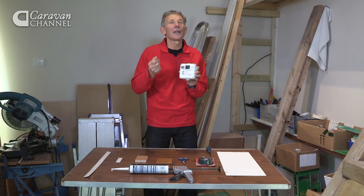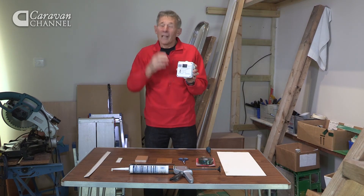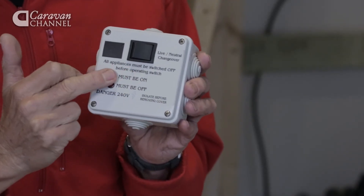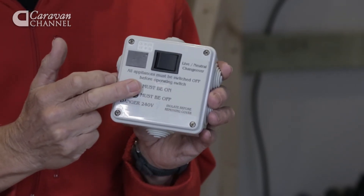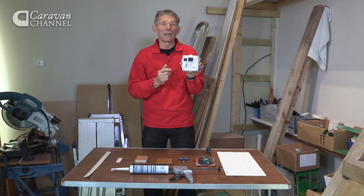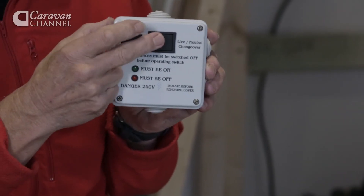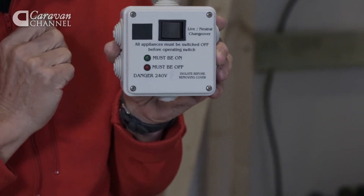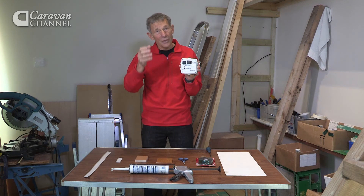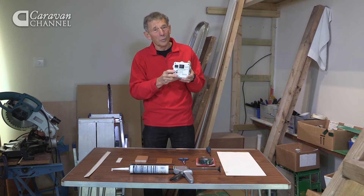The clever thing is that if you plug into the mains hookup and get back into your caravan, if the live and the neutral are reversed, not only will there be a light display to indicate that, but there'll also be a loud buzzer inside, which suggests you mustn't go any further. You can remedy it by merely switching it the other way, and then you proceed as normal — setting up the RCD, the security switches and so forth — and using the whole thing as you normally would.